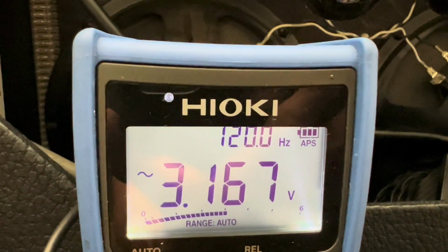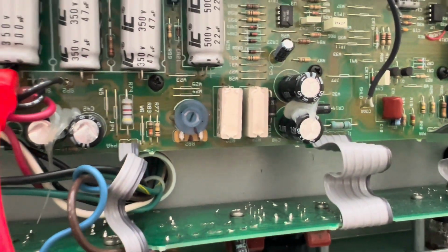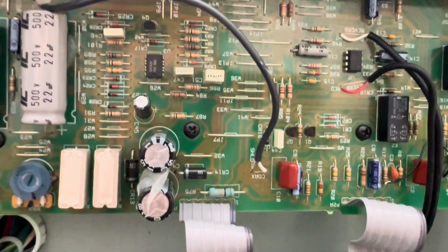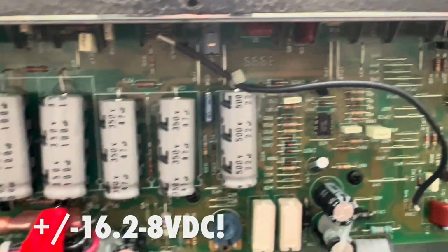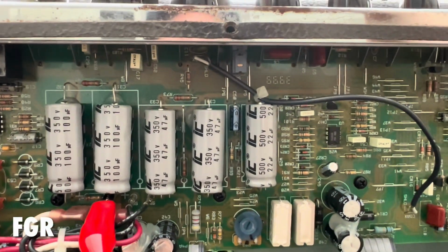And I would recommend doing a cap job, which is going to slip you up into the next tier of service that we had discussed, where we look at the low voltage, or rather bipolar power supply that's feeding your chipset here, your op amps, which are getting a good steady 6.2 through 6.8 volts of power. The channel switching is restored. You can see with drive just on 25%.